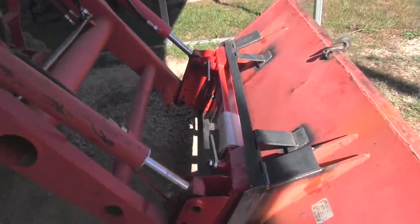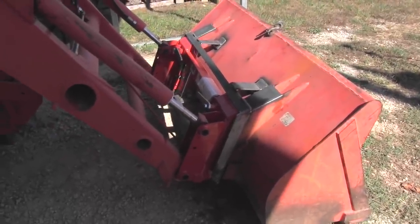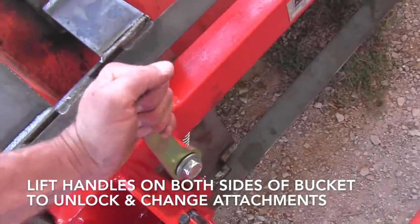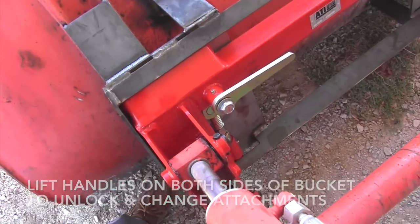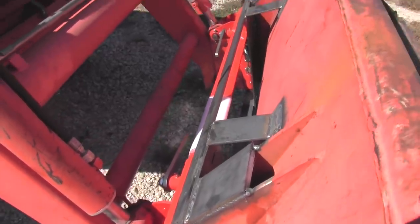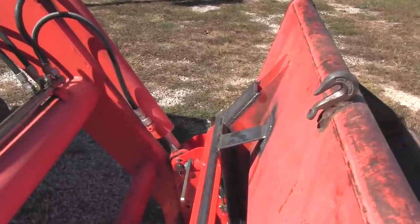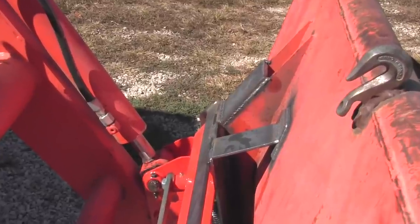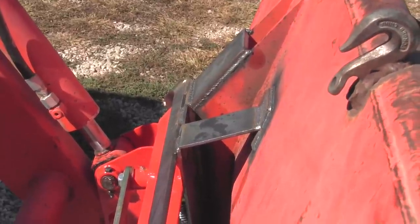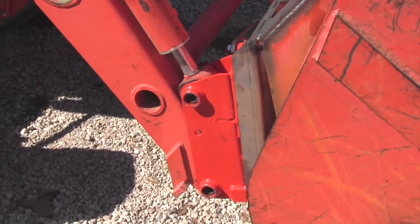Here are the brackets that got cut off the old bucket. They were very careful to maintain the exact angle that was there before, so the bucket is level on the ground the same as when it had the pin-on brackets on it. This angle right here is the same as it was when it was a pin-on bucket. Marvin's going to get some orange Kubota paint, and that's going to look like a factory job when it's all done. Marvin's off to work. We've got quick attach on his tractor. I got here about 8:15 this morning, by 9:15 we had the face plate on the front end loader and the bucket loaded in the truck to go to the machine shop. The machine shop had the bucket from about 10:15 to about 2:15, and it's done. Marvin has quick attach. You can put a bale fork, pallet forks, or a grapple on now, and really enhance the versatility of his tractor.